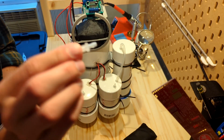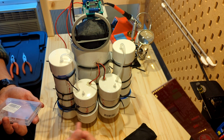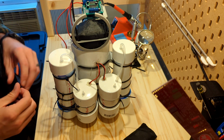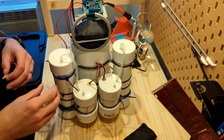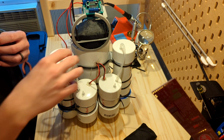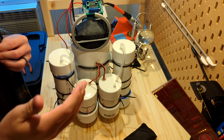And so this is great because they can go straight to a pump on the other side here. And so there's another hose that runs through and out to the other side. And then here I've actually utilized it so that there's another length of hose here, which will hopefully dangle with gravity to the lowest point in the tank, making it more likely, especially on the sucking motion, when we're trying to pump water out of these, that it will actually pump out water and not just air.